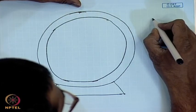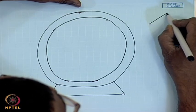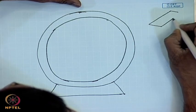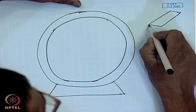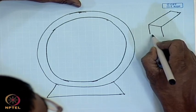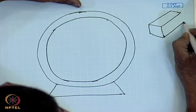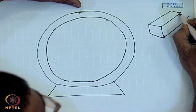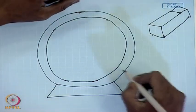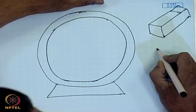The poles themselves are rectangular pieces of iron. Again, normally they carry DC flux, so not laminated as such - the body is not laminated. So, this is the pole structure which carries the field winding.